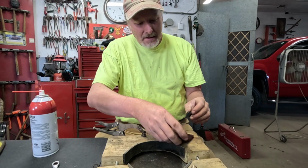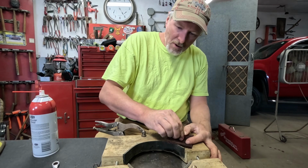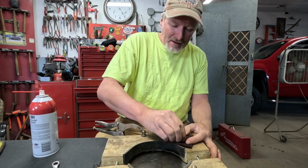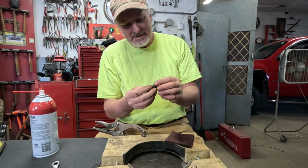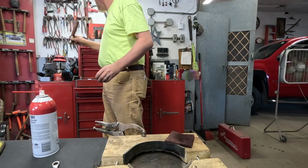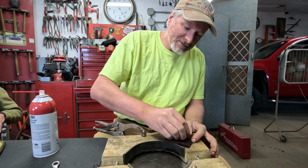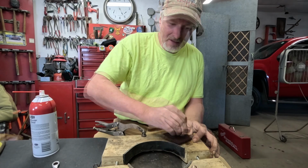But I definitely think that that valve will work, and I don't think that packing's so bad that I can't snug that packing down and get it to hold. So I wonder if that's a steel nut. The jam nut's steel. That's why I was polishing on it and it didn't look like it was shining up like the other brass parts were. BX does not have very much brass in it. Everything they could make out of steel they did.